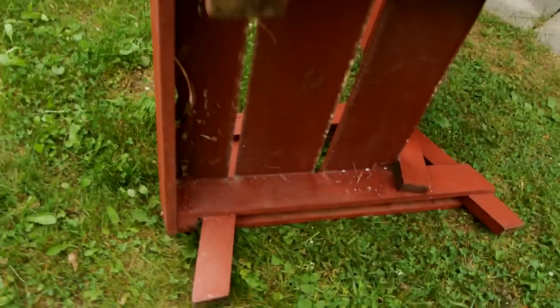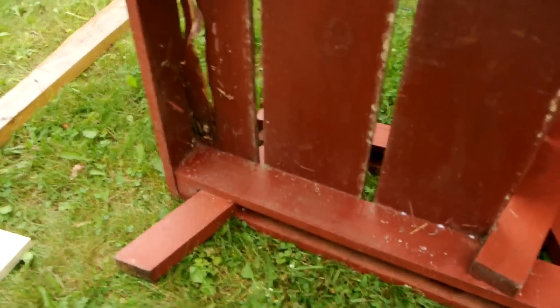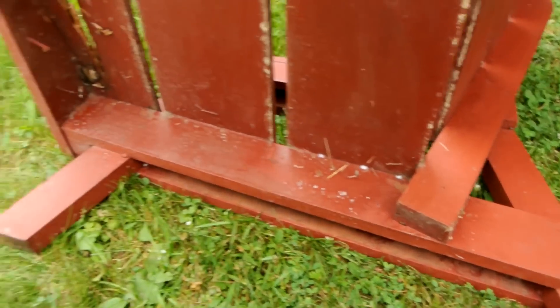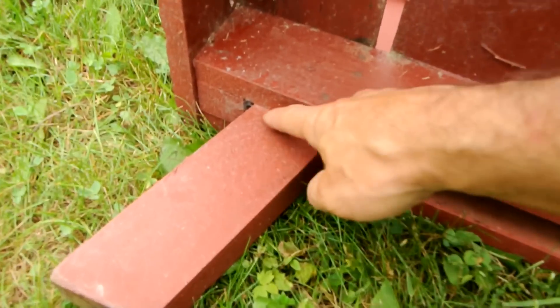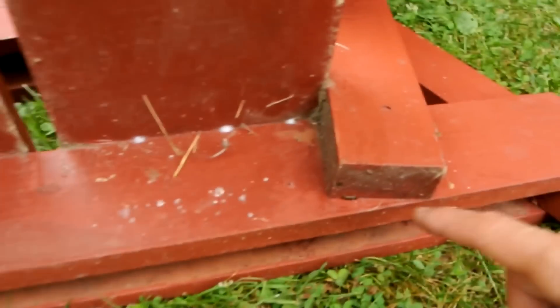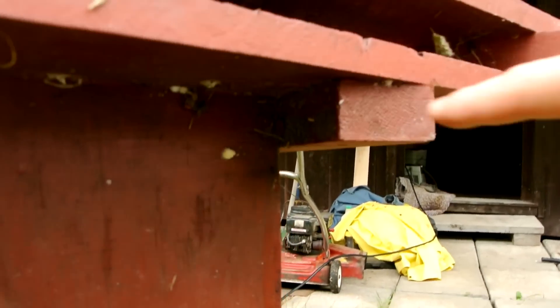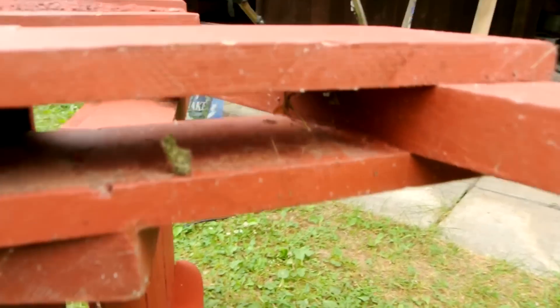Flipping this one over — the frame on the bottom, the legs, and these parts are made out of cedar, so they don't rot very much. And surprisingly, in joints like this, that's often where a lot of rot occurs, but my dad glued these together with weld bond, and it seems to be fairly effective at keeping the moisture out, and therefore keeping the rot out.